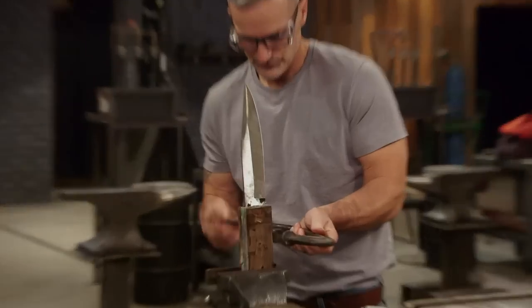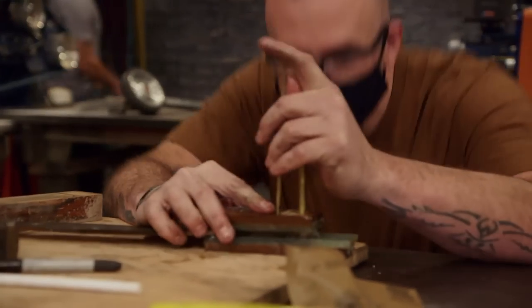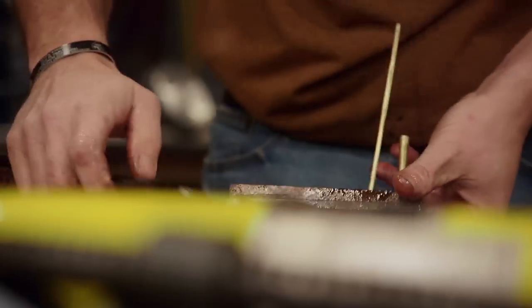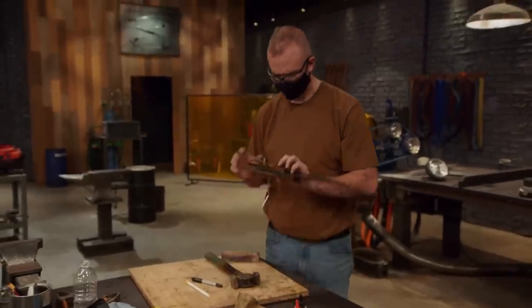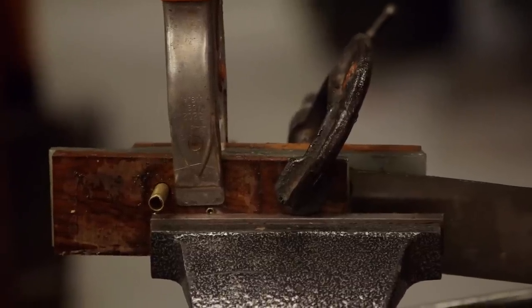I'm getting ready to epoxy this all together. Everything seems to be fitting up nice, so I put it in the vise while it sets. I'm going to use the G10 as the inner layer and sandwich that with the ironwood. I start putting my handle materials together, but I run into a problem trying to make the pinholes line up. I can feel the epoxy start to set up — at this point I am so stressed out, making little mistakes, not thinking things through. He's worked himself into a puzzle — they're still not matching up, basically making a hot mess. I don't have enough time to make another set of handles. I think I have enough material left — if I flip it around, it will still line up. Adam has decided to put those on all cattywampus. I've got one handle hanging off the edge and one hanging over the blade, but there's still enough material — I can grind and flush it up, and it's not going to be a big issue.